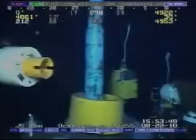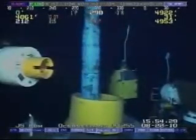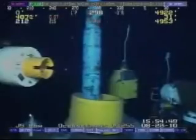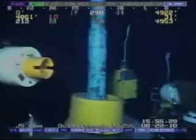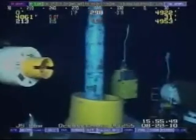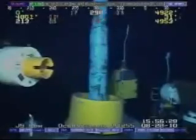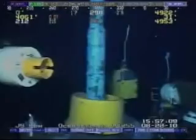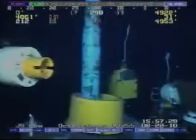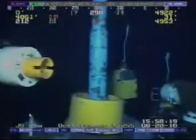Yes, another good question. We could have up to around 3,500 feet of drill pipe hanging below the BOP, and we believe that the drill pipe is being held by the BOP. So if we were to try to pick up the BOP right now, we'd have to lift it 3,500 feet straight up to pull all the drill pipe out, and then we'd have difficulty handling that.